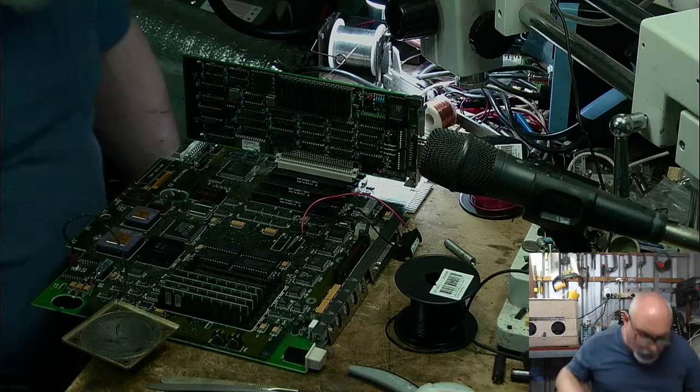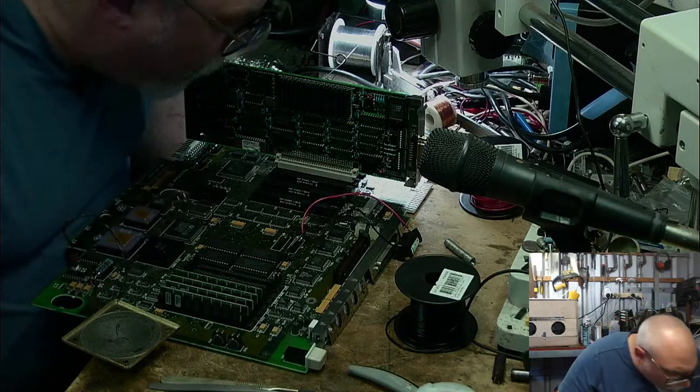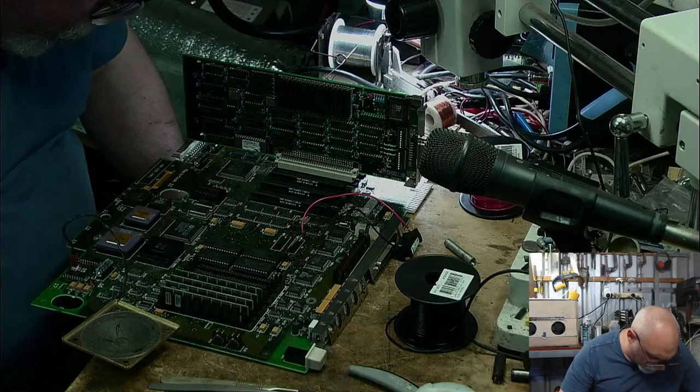You know what I didn't do? I didn't check all these caps. I'm doing that now. Just make sure the polarities are all right. I know he's got the right size caps on there, but...